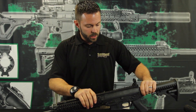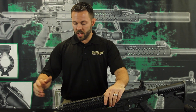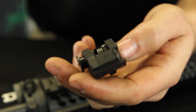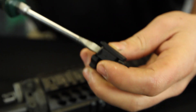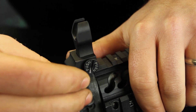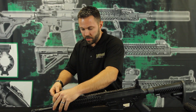For the front sight, as you see on the SIG 556 gas block, there's a dovetail cutout. Some 556s come with a front sight already there — there's a nut on one side. You punch out a roll pin, unscrew it, and tap it out. Ours uses a dovetail. We simply remove the screw — there's a screw on one side and a square nut on the other — and the dovetail is cut into the bottom of our base. It slides right into the dovetail cut on the gas block. We then put our square nut back in and tighten the screw, which will naturally center the sight.